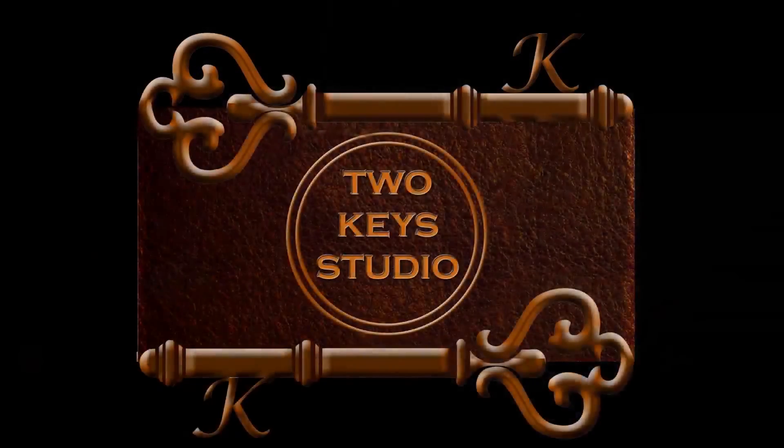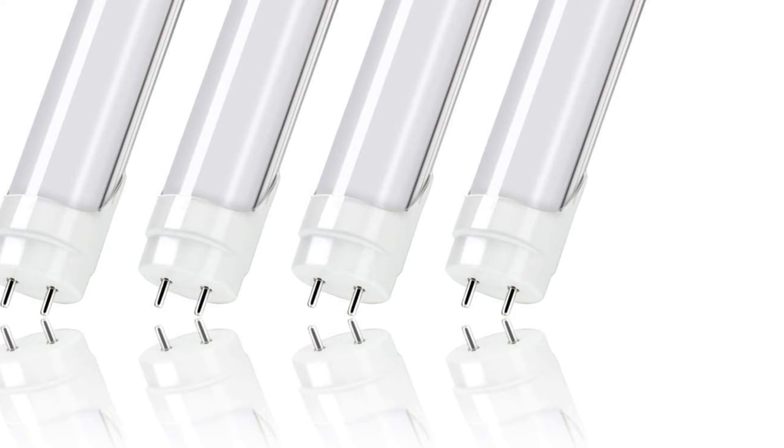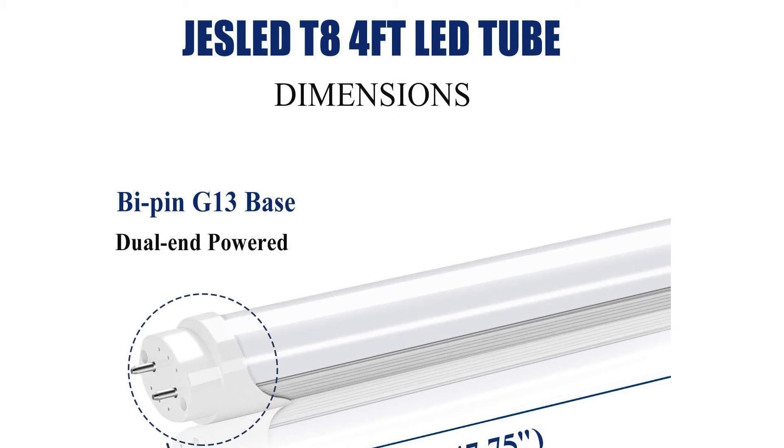In this video we're going to go from this to this using this. I've got the obvious flashing, blinking light up here and I'm tired of fluorescence, so I wanted to go to LED bulbs. These had pretty good reviews so I thought I'd give it a shot. Some claim you can just swap these in with the ballast still in there, but these do not say that and I'd like to get rid of the ballast anyway. So first I'm going to turn off the power and remove the ballast and wire these things direct. The same process can apply to any fluorescent light.